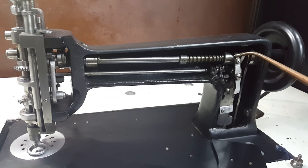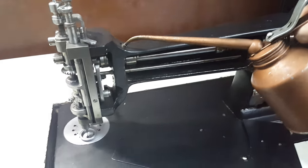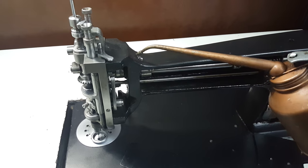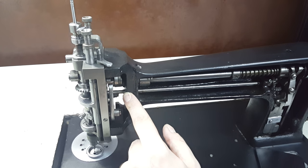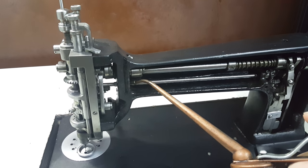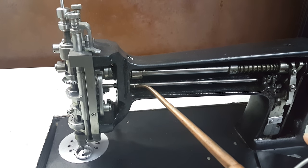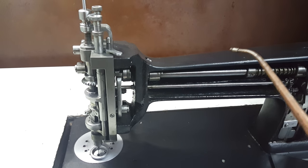Now we skip across to the left — you'll find another big hole at the top of the machine. Oil this one very well; it's protecting the main shaft through the body. You don't necessarily need to oil the small rod because the hole is generally bigger, but it can't hurt to give it a little oil now and then.